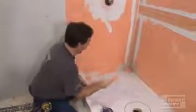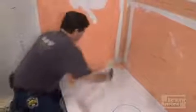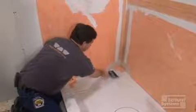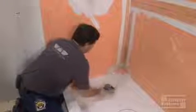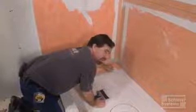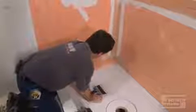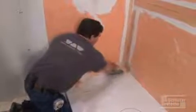Just to get it to flatten out. The corners are in first, and these corners did fit very nicely in here. The reason you put those in first is you might have a corner sticking up a little bit, so when you come back with the KERDI-BAND, that's going to cover anything like that. And you still have your two-inch overlap because the leg on our inside corner comes out a little over two inches. This is really going to reduce the buildup — you'll end up with three layers instead of four.